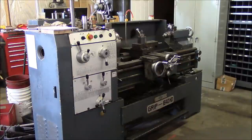That's going to be it. You can see that the machine overall is just pretty well worn and I'm going to have to make a decision whether to replace it or do some repairs — fairly quickly, because this is the only engine lathe I have and I really depend on it. It's a pain to do repair work on the CNC lathe; things like touching up threads, boring out parts for sleeves — that kind of work is still a lot better done on an engine lathe. That's kind of a round trip on how to evaluate an engine lathe — hopefully it's helpful for somebody.